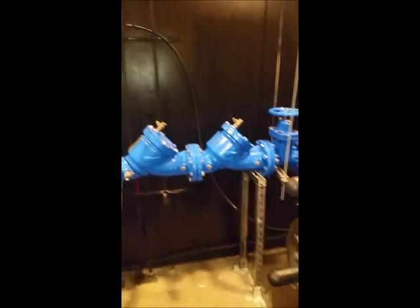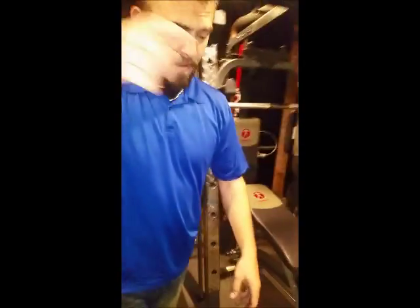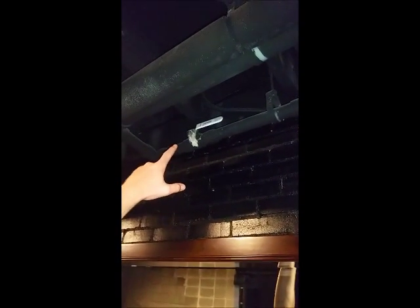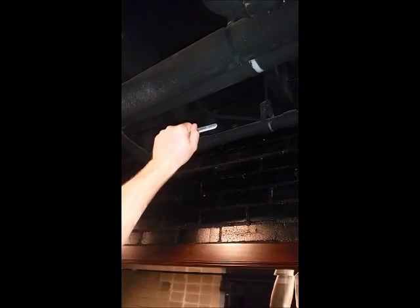Now, if you do have a little water leak and you know what it is, follow me in here and we'll take a look at some of these isolation valves. Each one of your restaurants upstairs and downstairs has an isolation valve. Let's say you get a leak right here — you shut it off by pulling down, you turn it on by pushing up. If you shut this down, it's going to isolate and shut down all the water to the upstairs suite 3.